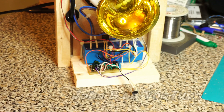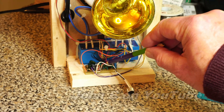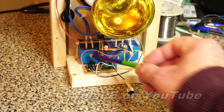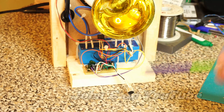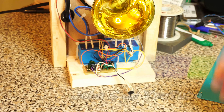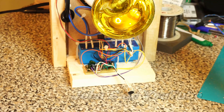We've got a microphone — I'll show you on the circuit drawing — there's a quad operational amplifier in there. I'm using two of the amplifiers, and I've got two mains transformers. They're not connected to the mains as such. The transformers are being switched on with a transistor from this circuit down here, and the transformers simply boost the signal from the op-amp and drive a silicon-controlled rectifier, SCR.